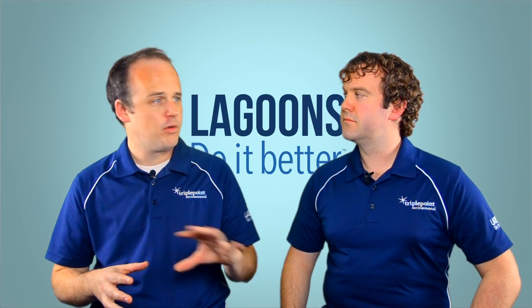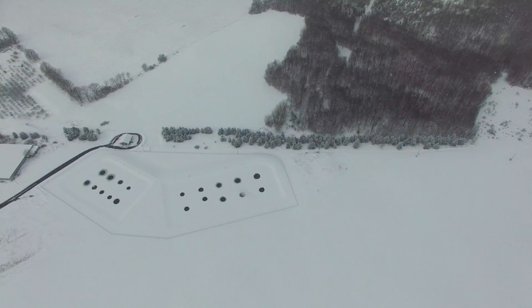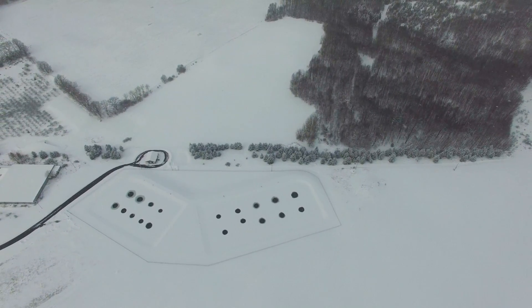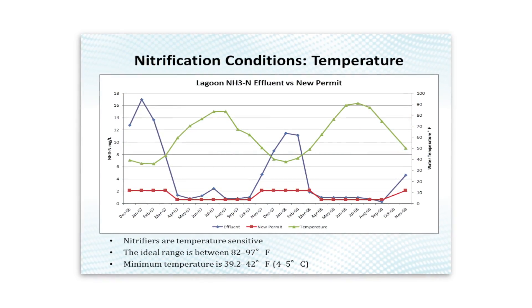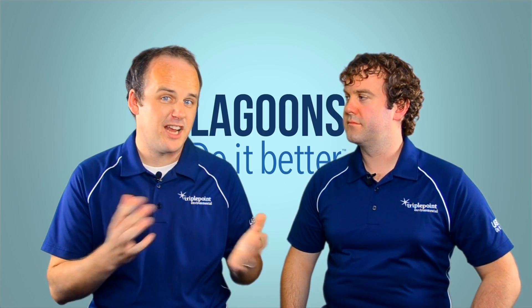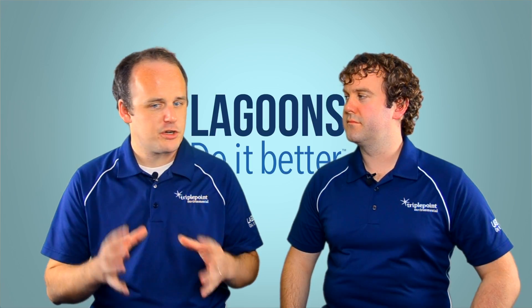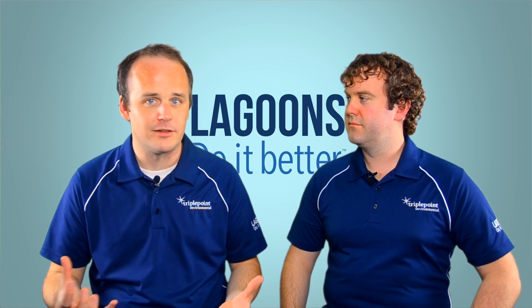For facilities in the northern part of the country, we actually regulate the temperature of the water. We can nitrify down to five degrees Celsius, which is a very cold water temperature. If you're in Alabama or the southeast, you won't see it get that cold, but up north it can get there for a couple weeks or months. So we bring the water temperature up just one to two degrees to guarantee nitrification occurs all year round. This way you're only paying for temperature when you need it — maybe a month or a week a year depending on location.